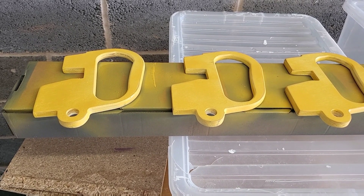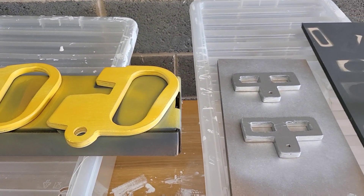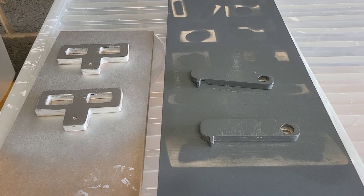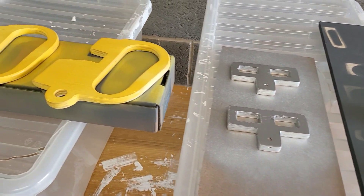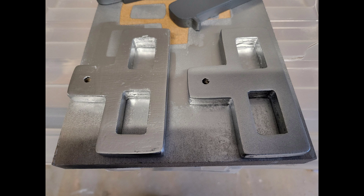I also take some time to paint the various handles for the flight seat. Although I had the idea to 3D print these, I did want to try initially if I could make them out of wood — it's just a question of trying to give them a finish where the grain of the wood is hidden to the greatest extent possible. Something really interesting we can see on screen: these two identical handles have both been spray painted with a silver metallic paint, but the one on the right also has an additional layer of clear sealant sprayed on, and that's given it a much smoother finish and done a really good job of hiding the grain of the wood.